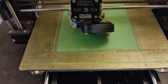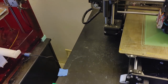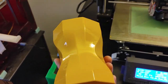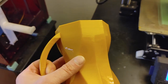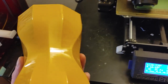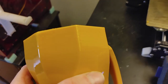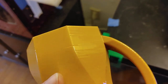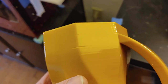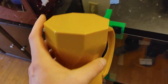I'm starting to print the mold box now. I've got a nice big fat nozzle on there so I can squeeze out the plastic pretty quickly. Our bucks have gone through the smoothing process and they look nice and shiny — you can see all the reflections. There is a little bit of a streaky horizontal look, but at least we don't have the real hard rough layer lines. It's nice and smooth to the touch, which is perfect. There is one imperfection, so I'm going to take some UV-curable resin and fill that in and hit it with UV light, then smooth it out with some fine sandpaper — I really don't want to reprint this whole thing.